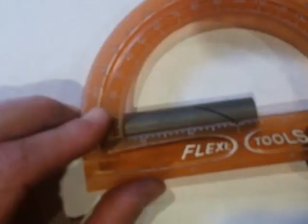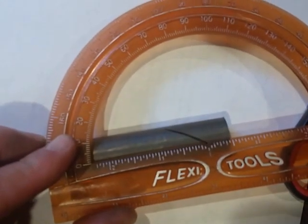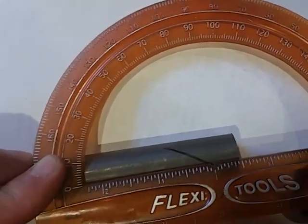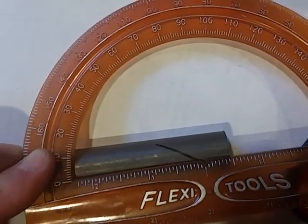I'm going to just line that up here where I want it. On both ends I'm just going to scribe a magic marker line to show the angle that both those pieces meet at. This doesn't have to be real rocket science — if we're within about 5 degrees we normally do pretty good. So I'm going to take a simple little angle finder here, extend that magic marker line out, and it runs out there right around 30 degrees.